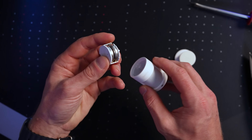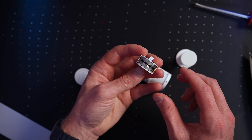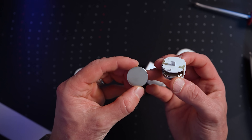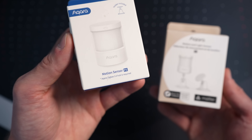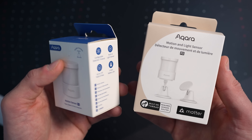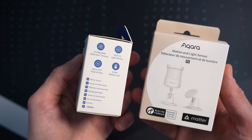The detection range of this sensor does seem to be slightly larger than that of the Aqara P1 Zigbee motion sensor. Battery life, however, is not quite as good. Just like the P1, the P2 takes two CR2450 coin batteries, but battery life is listed at up to 2 years versus up to 5 years on the P1. This really just comes down to Zigbee versus Thread — Thread is low power, but it can't compete with the battery life of many Zigbee sensors like the P1. Two years is still not bad if that claim holds up.